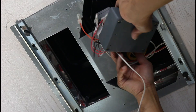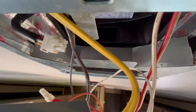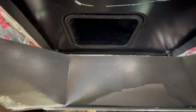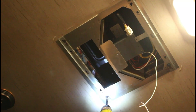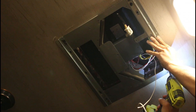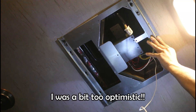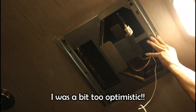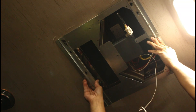Take out the electronic control box from the bracket. After the foam sheets are removed, I can see the entire chamber. The sheet metal divider sits in the middle inside. I notice that there is a gap between the edge of the divider and the duct inlet — this must be filled in for better cooling. My original plan was just to build new insulation walls around the existing sheet metal divider, but I realized that is not easy because the space inside the chamber is not large and it is difficult to measure the dimensions precisely.